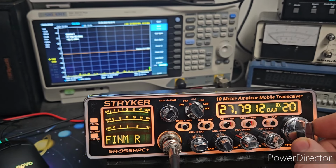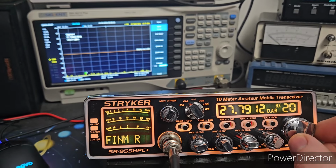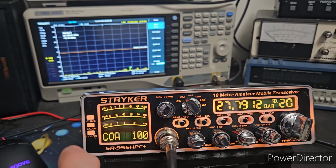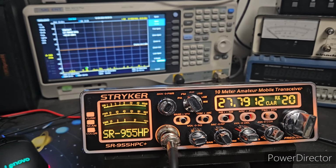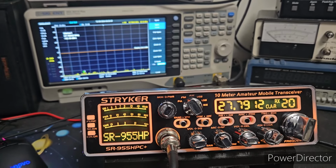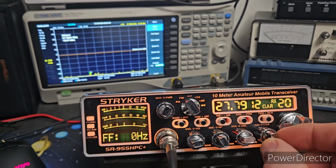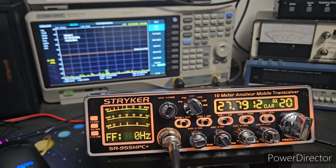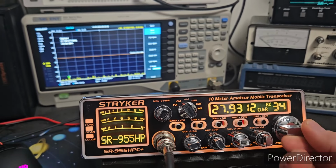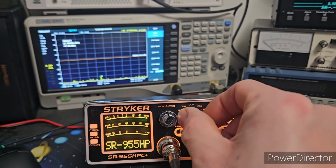But you don't want it to be in receive only. So that's a choice you have to make with the radio. If you want to use the UK FM, just go in and switch it. If you don't, then I would leave it in receive only. That way you don't have to mess around with the unlocked clarifier paired together. You don't need that on this radio. I mean, you can clearly tune somebody in no problem without shifting to where they are if somebody's off frequency. So that's pretty much covering that. You can go to any one of these channels and do that just like I showed, and it will be on frequency. So just wanted to show that.